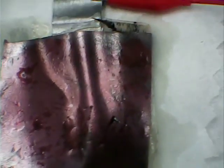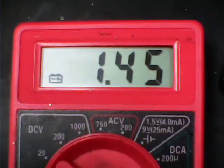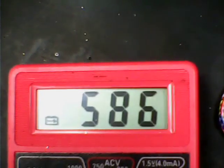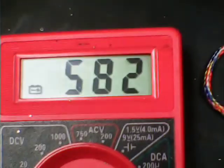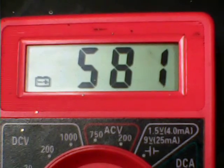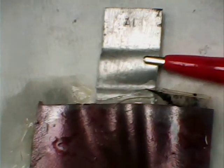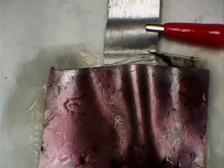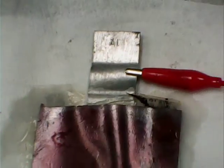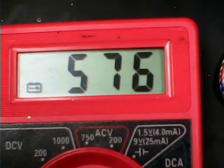We know it is functioning right now, otherwise we wouldn't be drawing current. What's the open potential, the open voltage? It's 1.45 volts — could be as high as 1.7, but under these conditions, 1.45. Now let's see what the current is — that's what I'm concerned with. Going to microamps, I'm coming in at about 585 to 590 microamps, and that is pretty good. It's holding its own — that's important. My goal here is to go pure solid state. The power output on such batteries will not be great, but it will be steady — a steady outgoing current to rely on. We're staying there at 577 microamps; that's certainly not dropping.